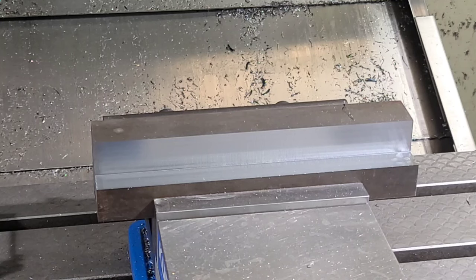This little shelf that we just did — that one end mill could likely do 500 of these parts no problem and still be usable. The coolant is absolutely unnecessary and has no function here.